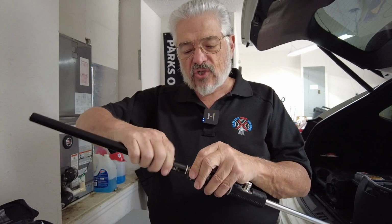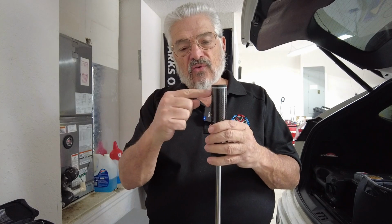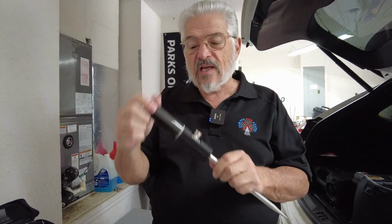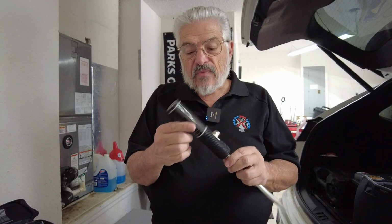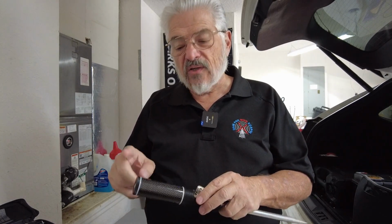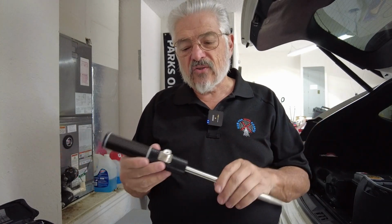I would highly suggest, and I may do this myself, I'm going to drill a hole through here and tap that and put a screw in there to keep these two pieces together, because gluing it, they had nothing in there to hold it together. So they could put a screw in here into the plastic piece inside. That'll keep it from moving. Also, the cold solder joint on here and cold solder joint on here was not a help. The wire pulled right out as soon as it disconnected.